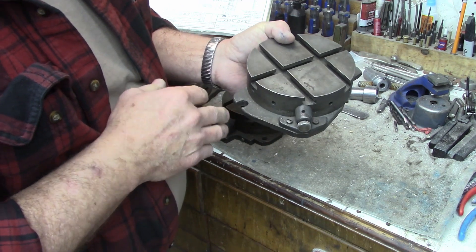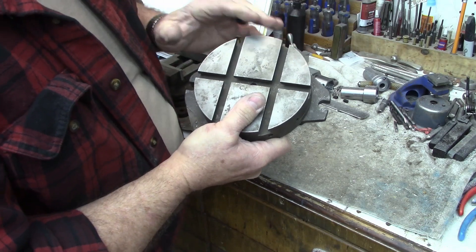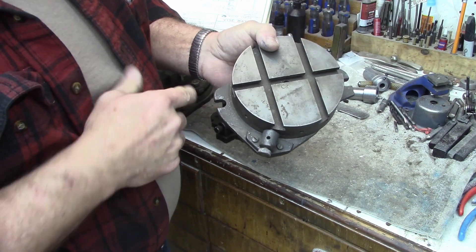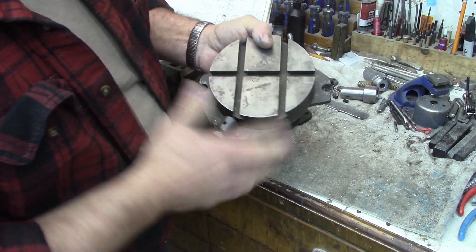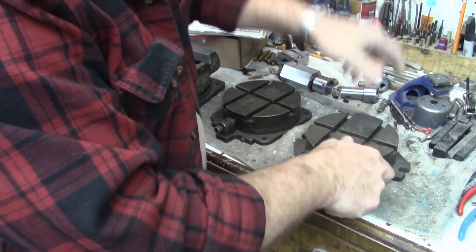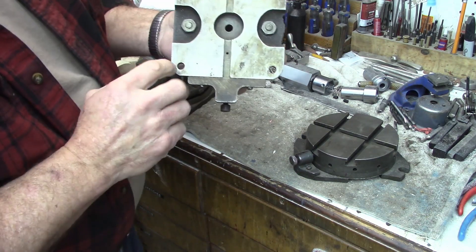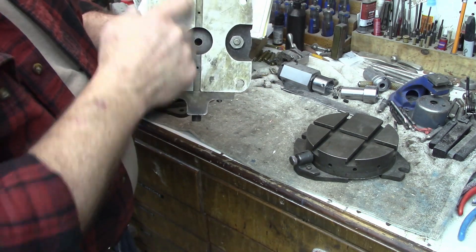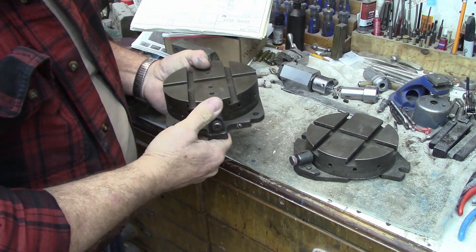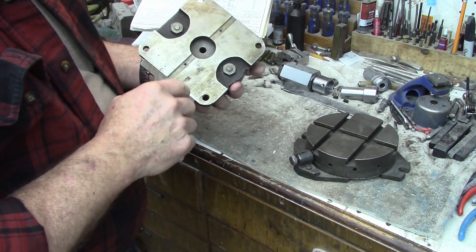The print for the base for the vise shows holes, but they also slot them. I've never seen a base for the milling machine — with either the vise or the rotary table — that just had holes; everyone I've ever seen has had slots in them. Now when we look at the rotary table for the shaper, the base fits the shaper. Same thing, except it's got four mounting holes and it's got the key in the center, because you've got three T-slots going down the table on the shaper.